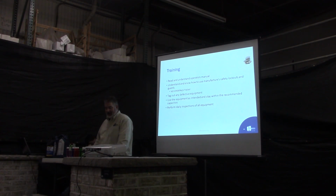Okay. Tag out any defective equipment. If you've got a piece of equipment that's got an issue and you have several guys that use it, well, one guy knows about it, but he might not tell the rest of them. If you don't tag it out or hold the key, the next guy's going to jump in, fire it up, and drive away. Well, the problem might have been that the fuel filter fell off, or the oil filter fell off, and it's got no oil in it. If you don't lock and tag it out, that engine's going to last about 3 minutes. And then you're going down and spending $15,000 a night. It's important to make sure you lock out and tag out any broken or defective equipment.